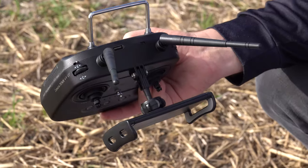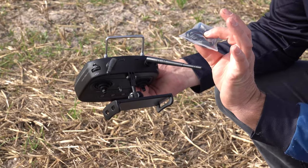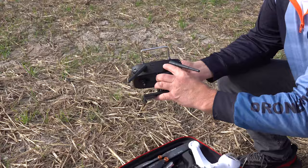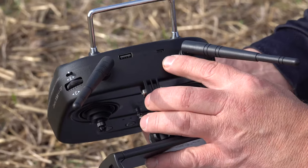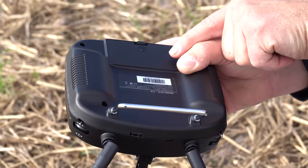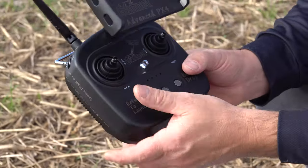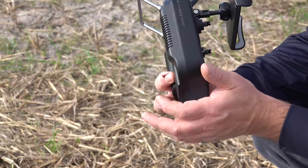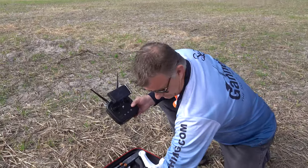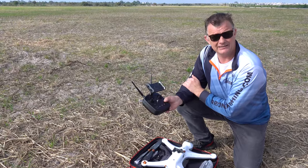This little connection has its own little bag with a micro USB and also an S-Video cable. You'll use this to do your video settings for feedback to you. The micro USB is also your charging — this is a 5-volt charging unit. You've got two 3.7-volt lithium batteries. The radio has about plus or minus 20 hours on standby. When coming out to fly or fish, make certain your LiPo batteries have been charged to full voltage and your radio is also charged.